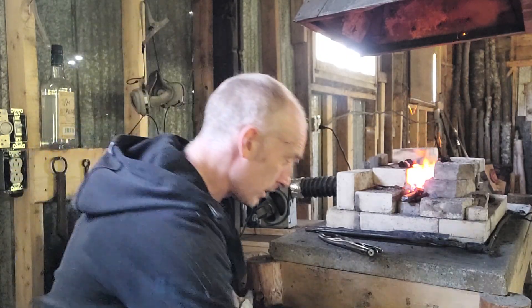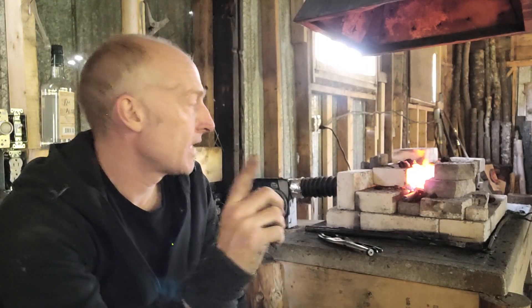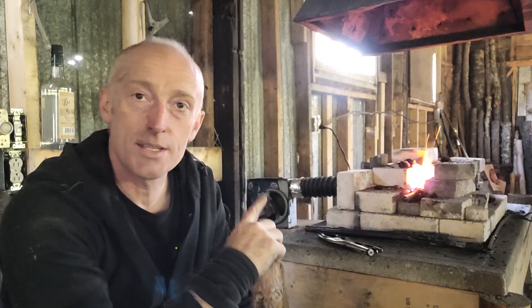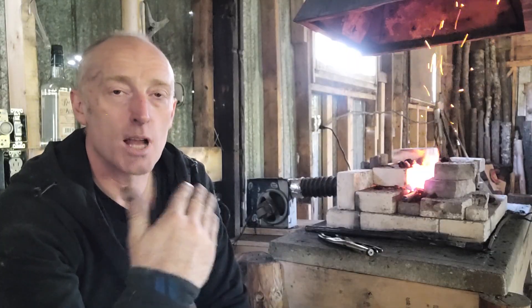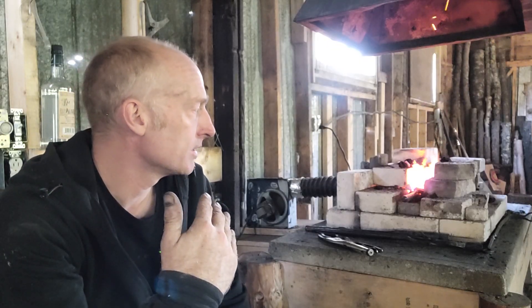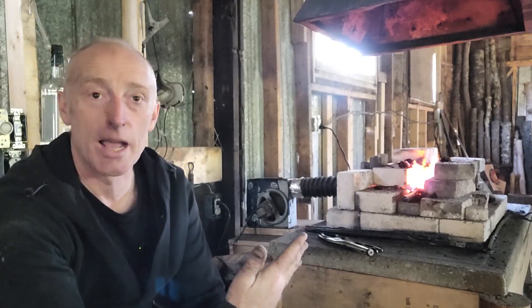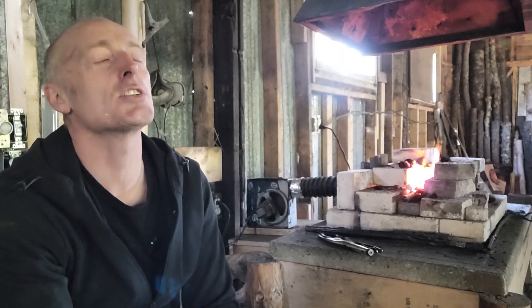You are going to learn where and when to strike your steel through its color — observing the color early. This allows so much more visibility. In a lot of my videos I bring in more light to share what's going on, but when I'm forging for myself I want this place as dark as possible — it gives me the best sense of what's going on. When you are not actually working, you're really blind as a bat. You have to stumble around to find your water bottle. You need to know where your charcoal is lined up, because if you turn the lights back on and off, it just takes your night vision away.